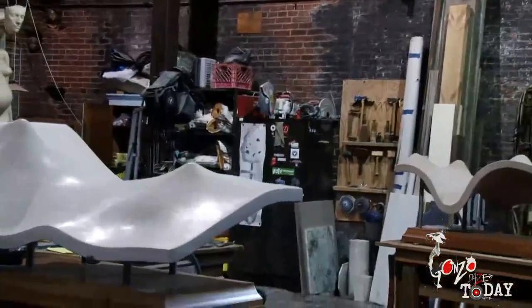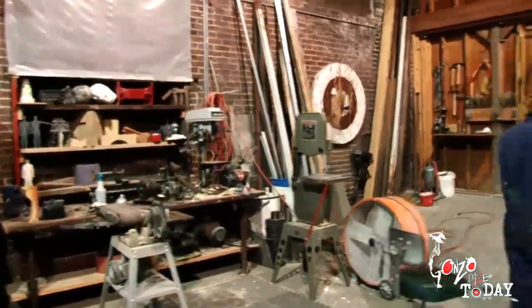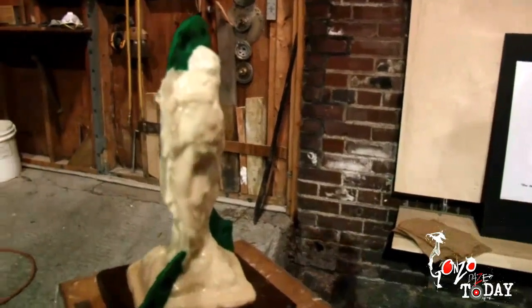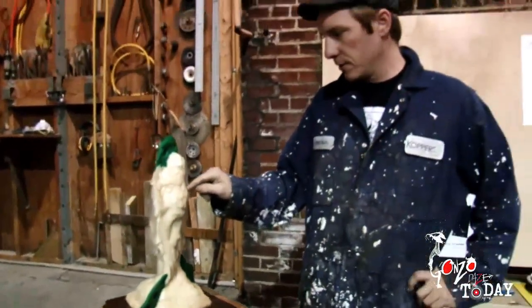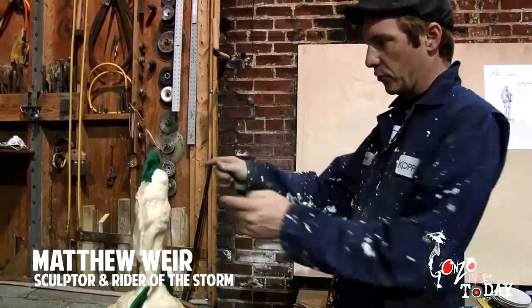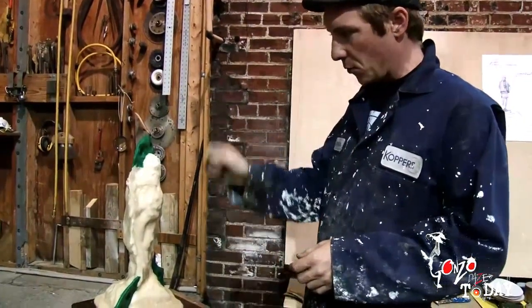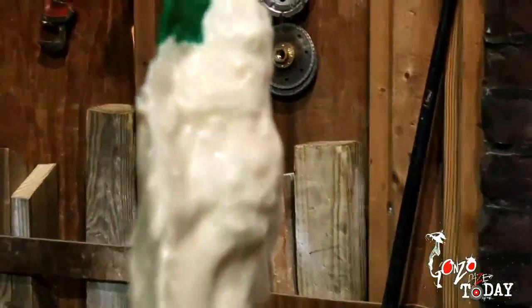Enjoying some National Public Radio — it's all I listen to, man. It looks beautiful, just like a cocoon. So this is a polyurethane rubber mold — it's a flexible mold. I'm about to start on the second part of the mold. This is a two-part rubber; those buckets and all that on the table are the chemistry and science behind mixing it up. When you combine the two rubber types it's a one-to-one mixture.